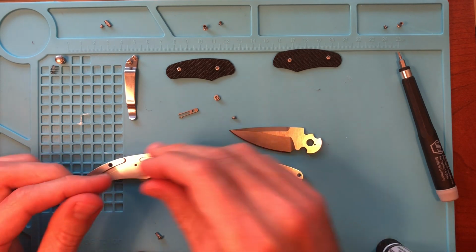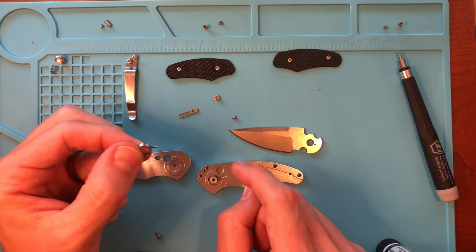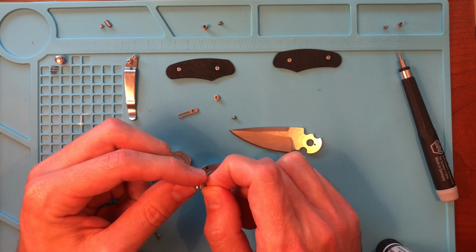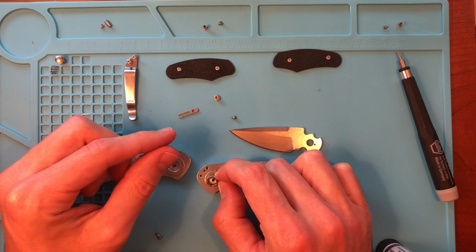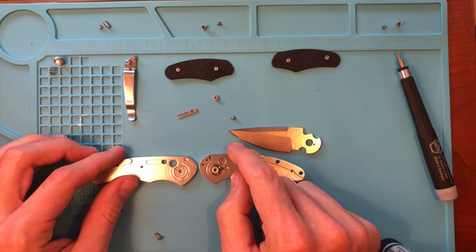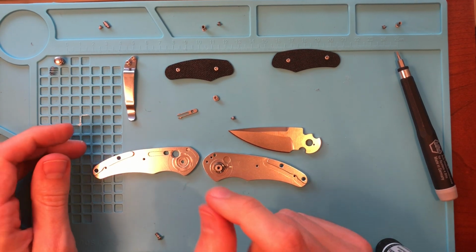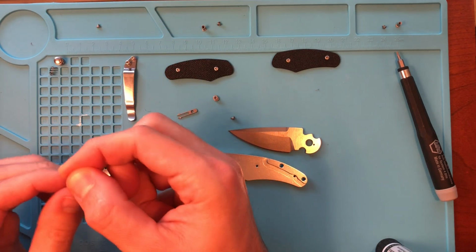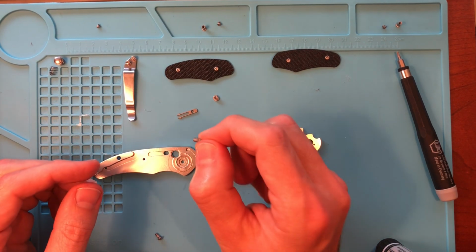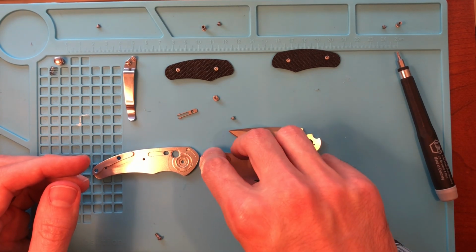So this is the auto spring. It's got this tail on it here, and that tail, make sure the blade side's up, which is where it's nosed up, and the tail goes down in that slot just like so. And then from there we'll go ahead and put back in our stop pin next. So the stop pin, I didn't find there was any magical direction that it fits in there. Just toss it in there.